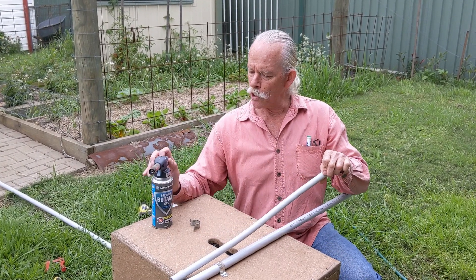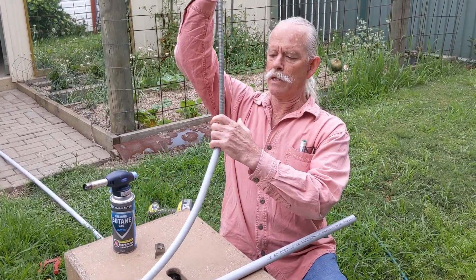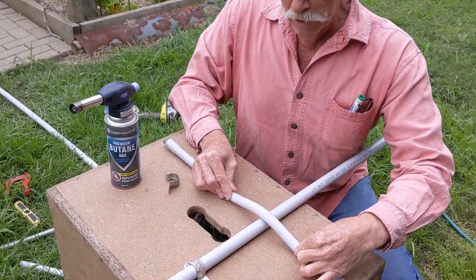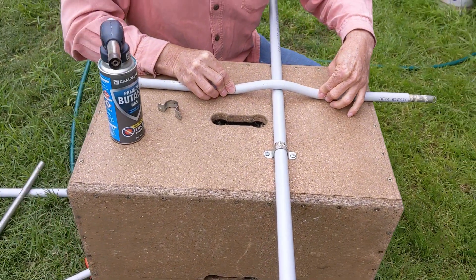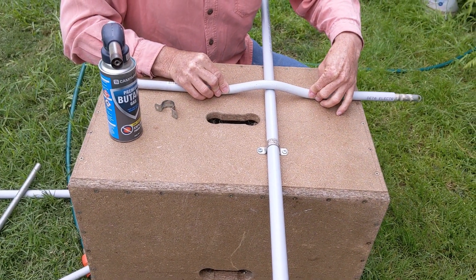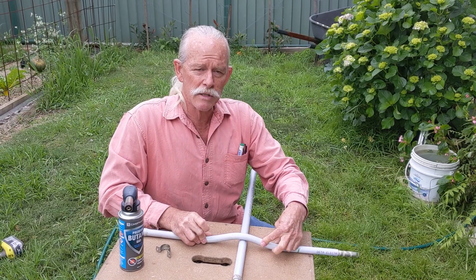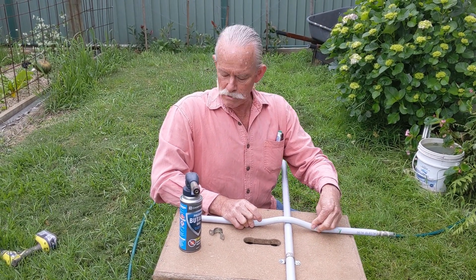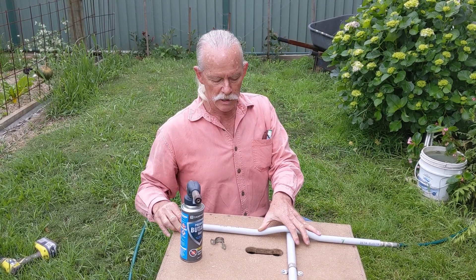Now I want that good and hot, and as you can see it's a little bit squishy. Now I can slide a spring down the centre of there — that'll make it go cold fairly quick — and I can just set that over the top. Because I put a spring in there, that'll help the conduit maintain its shape, it won't decrease its diameter, and it'll also cool the conduit. That's already hard because the spring itself has sucked the heat out.